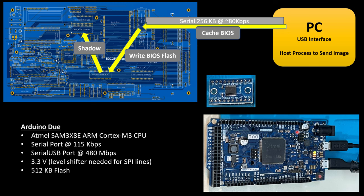In my 5 volt 286 system, that's something I have to pay attention to. I'm going to use one of these level shifters. I've actually used the Due with this level shifter in my 65816 system and that worked quite well, so I'm going to do the same thing here. I'm going to pull my SPI lines from here, run them through the level shifter, and connect them up to the SPI pins on this device — four lines total.